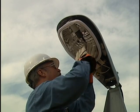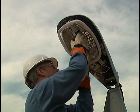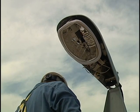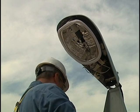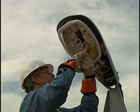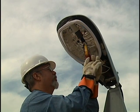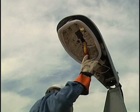Insert the short cable leads into the test adapter. Turn on the clamp meter and clamp onto the short cable. Put the meter setting to amps, or A, on the meter.